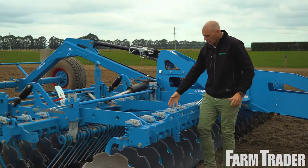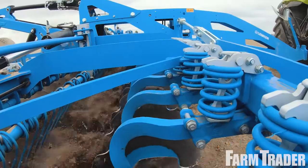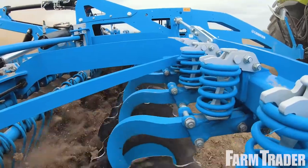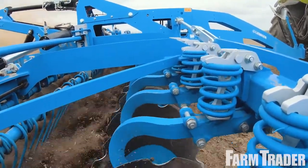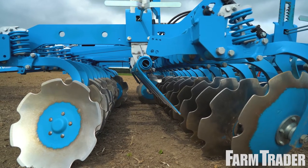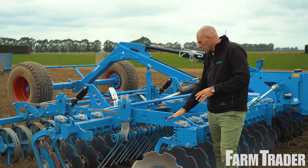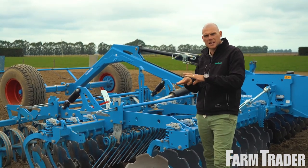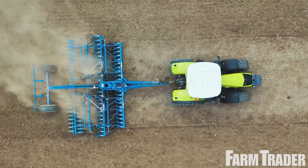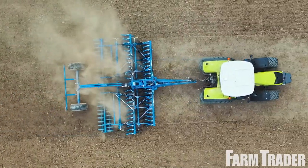Another key feature: each disc has a coil spring. Looking at this one from the side, the coil spring allows the disc and leg to keep the weight straight on the disc, so you get great ground penetration — which in conditions like this is exceptionally important. You've also got the 640mm disc on the bottom, with various disc options available. This spring allows each disc to move independently of all the others, and if you look across the discs as they're working it looks like someone's playing the piano — just up and down, chattering along. That allows two things: the stress isn't being put through the frame as they all move independently.